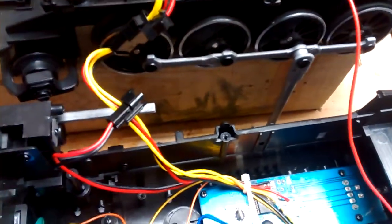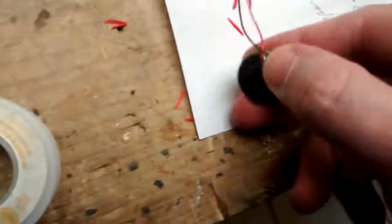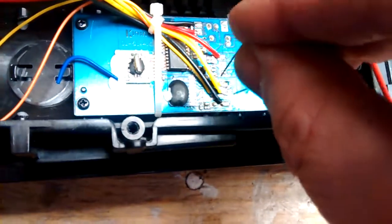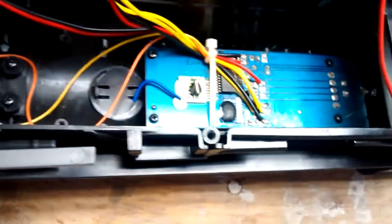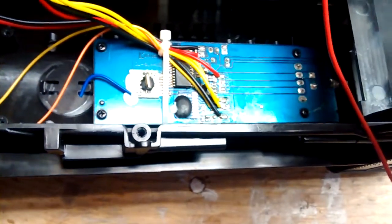So what I did there is, hold on, I've got a thing hooked up. For some reason, if you hold on an additional load, like a speaker, or just a resistor, on the output of the speaker terminals, it's a differential output, and what I'm doing is I'm loading down one side of the differential output to ground, and that skews, anyway, it's a long explanation. But what it does is it recovers the sound when you have no sound.